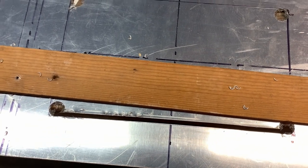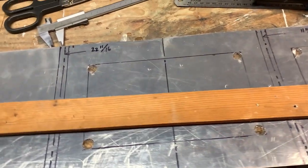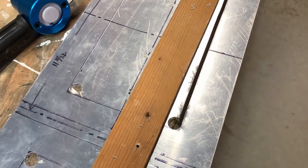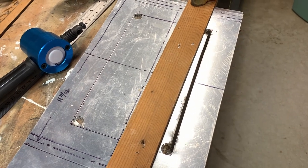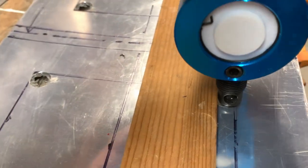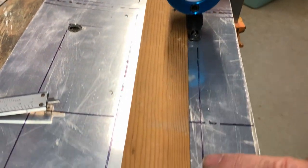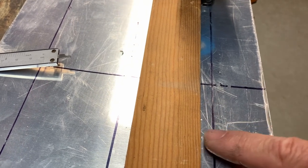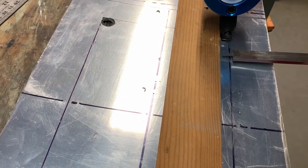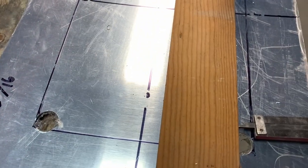Here's the first cut I did with the nibbler — as you can see it's very straight. I'm going to set up the second one now and videotape it so you can see how I use the nibbler to cut out these holes. I'm just using this piece of wood as a straight edge. I set my nibbler in here and the distance from the line to the edge of the wood for my nibbler has to be nine millimeters. I use my calipers to make sure everything is parallel.